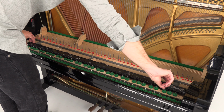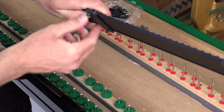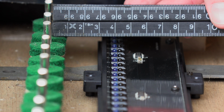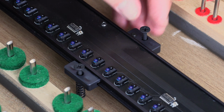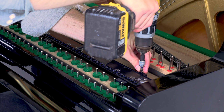Pay attention here. Put the sensor reel with the LEDs towards you. Put all the springs on the brackets and position the reel with the sensor LEDs at 4cm from the front rail pins. Now you can screw in all 8 screws. Screw them in all the way, we will unscrew them bit by bit later for the calibration.